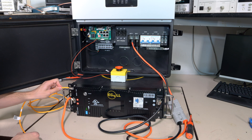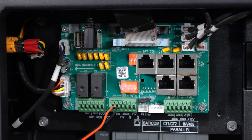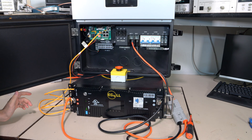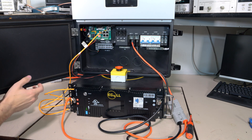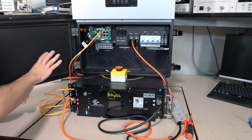To make this feature work, we need to plug our cable into the CAN bus port of the battery, and the other end of the cable goes into the batcom port. Just for demonstration purposes these wires are going through the front of the inverter; obviously you would want to run them alongside your battery cabling, not through the front door.